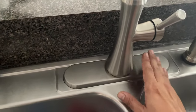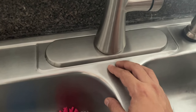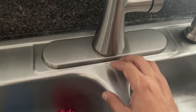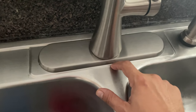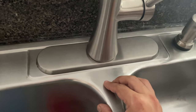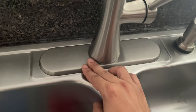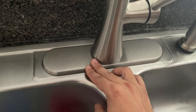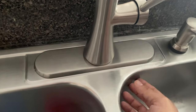After some time we noticed that there is a small leak between this plate and the sink. We found some water drops that were getting under the sink. The issue here is that this plate's gasket is not making a good seal with the sink. In most cases this should not happen, as this plate's gasket should prevent water from coming in. But if you are getting a leak, I will show you how to seal this plate so that you don't have any water under the sink.